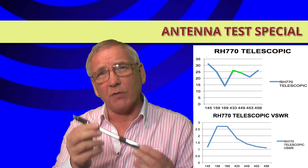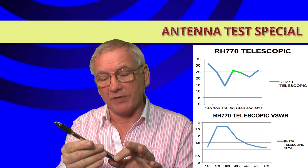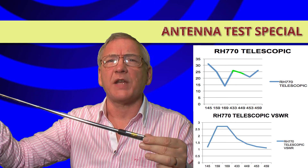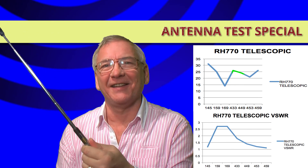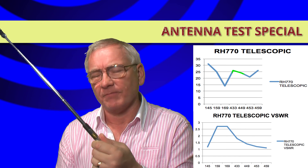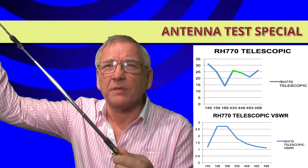The unbranded RH770 is a strange beast — chrome at the bottom. It says 'wideband received coverage' and '144/430 MHz,' but the best bit is it extends — and extends — and extends. With both sections out it goes from one end all the way to the other. Balancing that on top of a radio is worrying because it's very rigid — I reckon that's a pretty good candidate to snap your antenna socket off. It performs quite well, but it's just a huge beast.